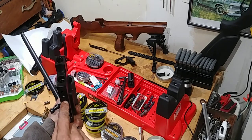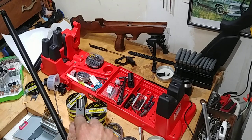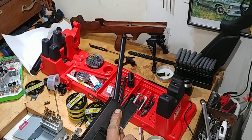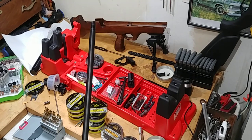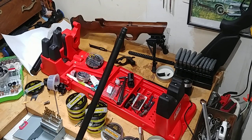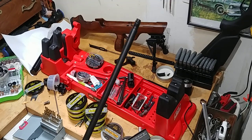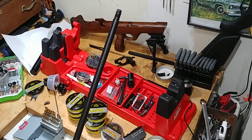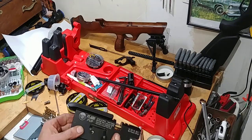So that'll be all cleaned out. If I can, I'll get the 190 thousandths and just chamfer that hole that's in the bottom of the tube. So we'll just clean that up, clean everything up, good chamfers on everything, and then I will be opening up this. And this one is really smooth. My Flash, I cannot unfortunately say that it was as great. I needed to do a lot of work in there and clean everything up.